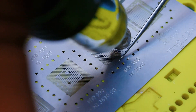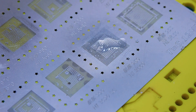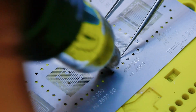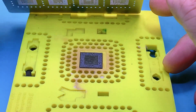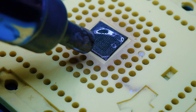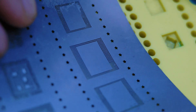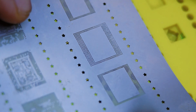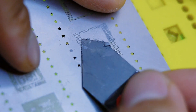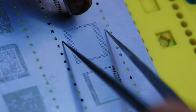It's incredibly satisfying to watch. Add a bit of flux and reflow again to make sure the solder joints are firm and clean. If some solder balls are slightly off center, reflow again to let them self-align. Repeat the same process to reball the top cap — it's much easier. Just make sure it's clean beforehand. Use the same settings: 320 degrees Celsius and air flow 100.